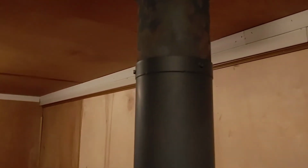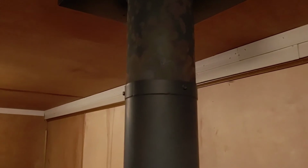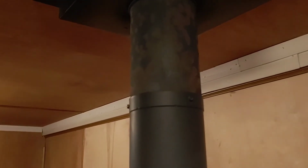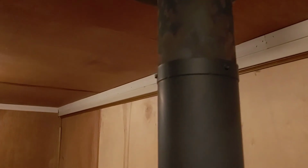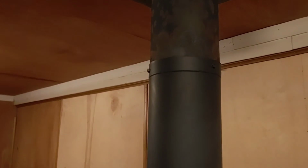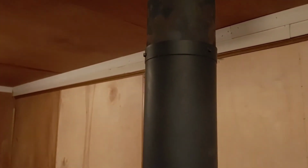I don't know. But two, when I was showing you up the pipe earlier, that's after, I think, 3 weeks of burning, just 3 weeks of burning. That's what my pipe looks like, all the way up. And it'll look almost identical to that at the end of the season. I have not had to get up on the roof but once or twice to run my brush down and clean out the pipe. That's only if I only had green wood to burn and was worried about some buildup. And 9 times out of 10, I didn't really have any buildup in the pipe.